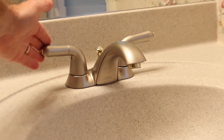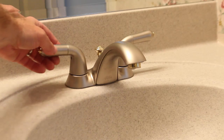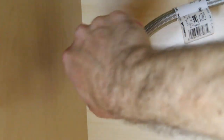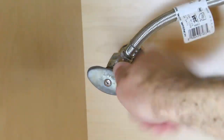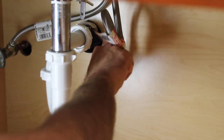This video is going to show you how to remove a faucet like this one. It's simply a two-handled faucet, and the first step you need to take is to turn the shutoff valves off. You need to shut the water off. Turn the shutoff valves completely to the right, or clockwise. There's a hot shutoff valve and there's a cold shutoff valve.